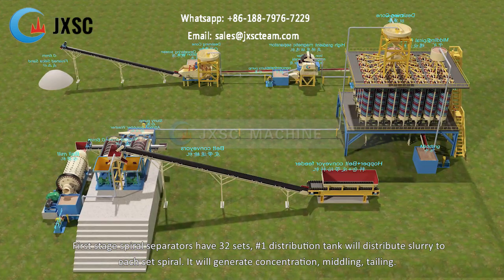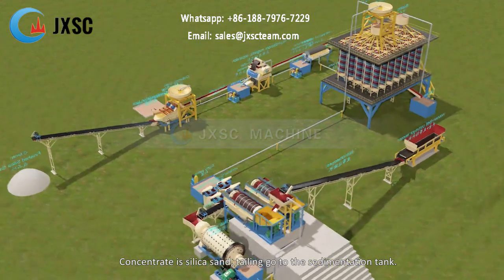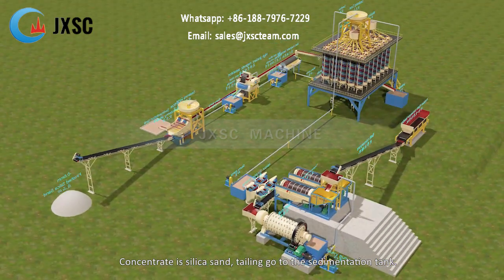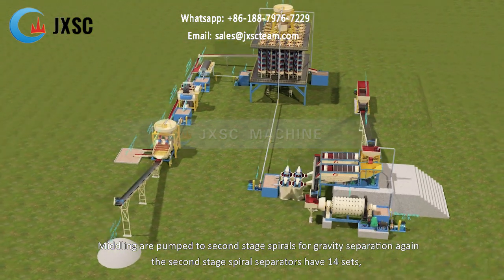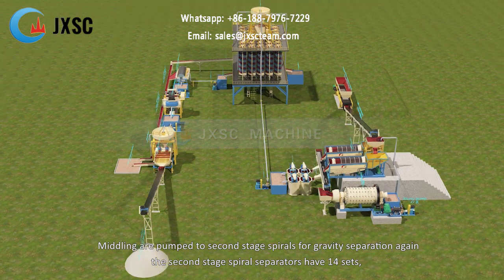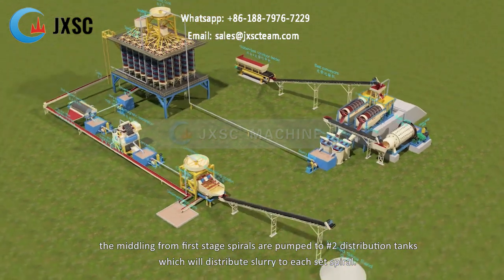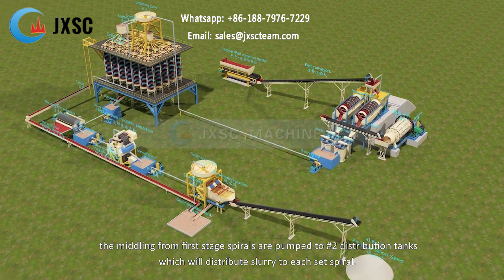It will generate concentrate, middling, tailing. Concentrate is silica sand. Tailing goes to the sedimentation tank. Middling are pumped to second stage spirals for gravity separation again. The second stage spiral separators have 14 sets. The middling from first stage spirals are pumped to number 2 distribution tanks, which will distribute slurry to each set spiral.